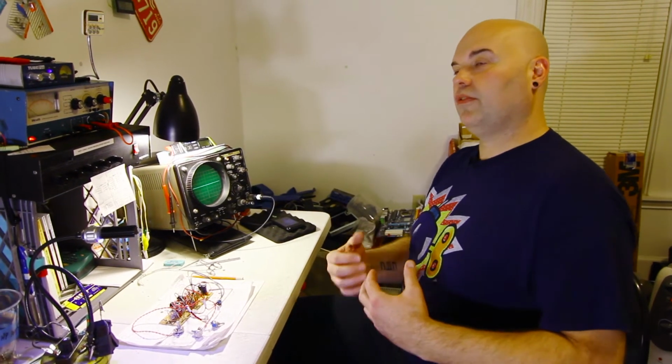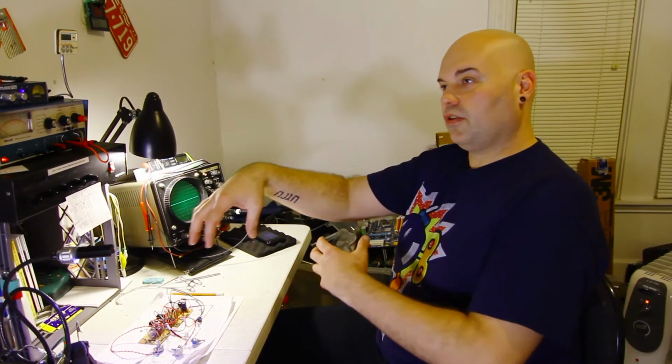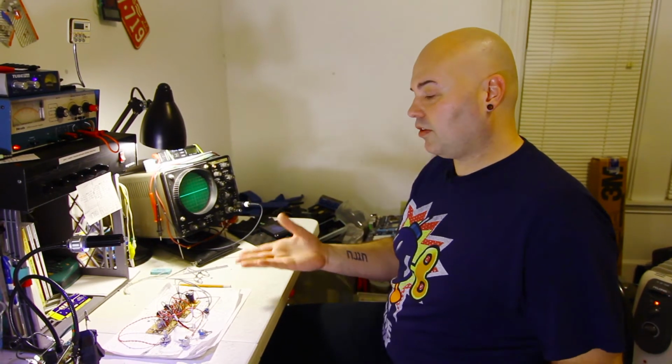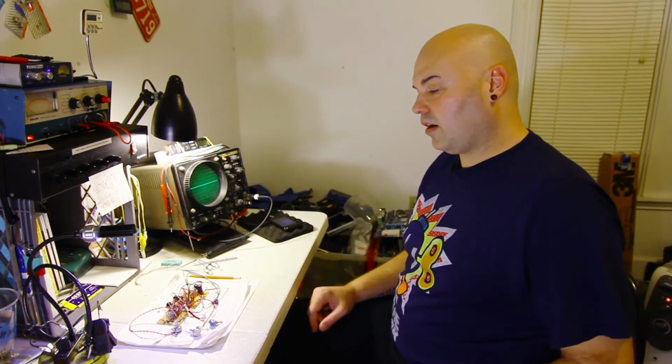And then that feeds into a section that isolates the outputs of that preamplifier, one going to the camera directly and one going to auxiliary outputs on the box. None of those are physically connected to one another, so none of them can interfere with one another, and you get a solid, reliable output from it that way. And then there's a headphone amplifier as well, so that whoever's using the camera can just plug a set of headphones in and listen, and it's all right on the box.